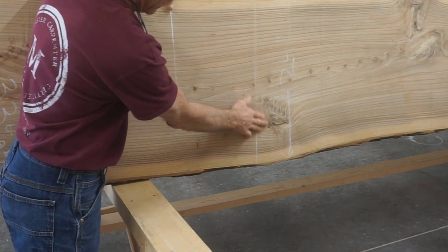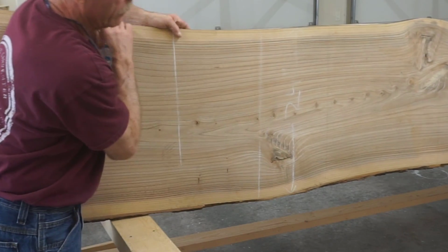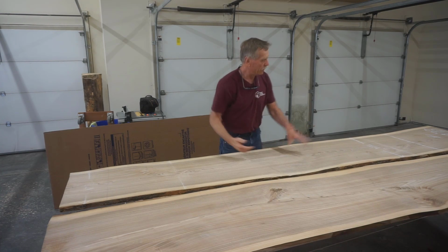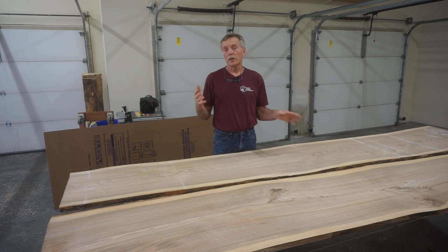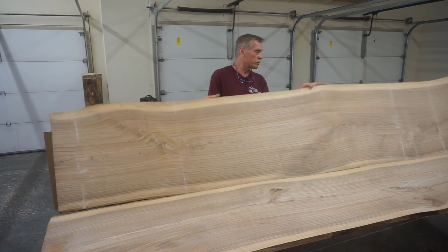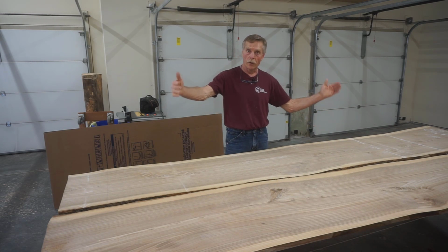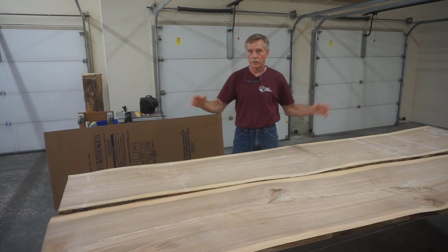And you can see the change as it's gone through that 5/4 inch thickness. It gets smaller here but it's more pronounced and it's deeper. The match to that knot is somewhere else on the backside of one of these slabs. But working with the designer to figure out the best overall look of the piece, these pieces were flipped face for face, end for end, top for bottom, every which way you can imagine, to come up with the contour that works in the size that the overall panel for these doors is going to be.